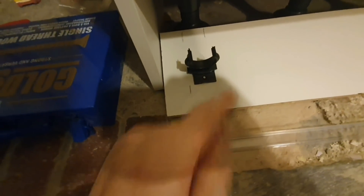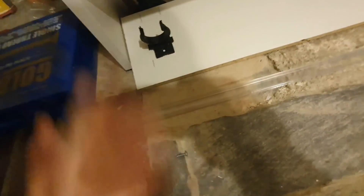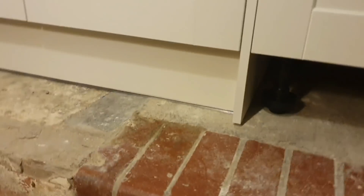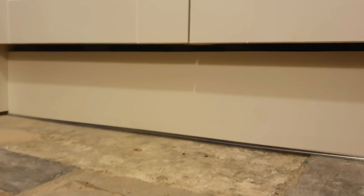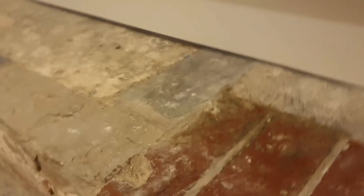Put your bottom plastic on, flip it up and push it in - there you go, first one is in place. I've got a gap underneath and that gap is going to allow for my laminate flooring. I can prise it up with a screwdriver and my laminate floor goes straight under. Continue doing that for the other two - just take your time, it's a really easy process.